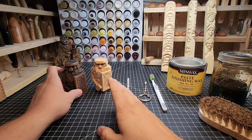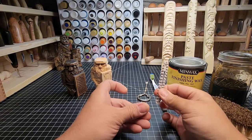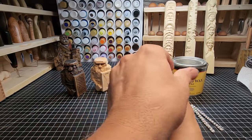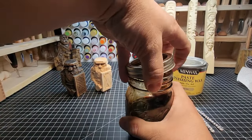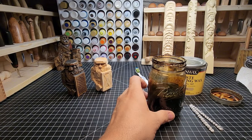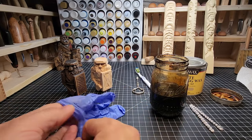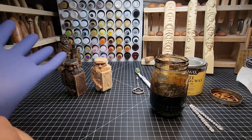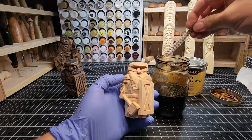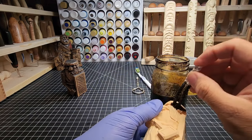They can be handled more than painted pieces — if you paint, carvings can get smudged and stained. For applying this I use a little pipe cleaner folded over in half. I'm going to open up this mason jar I use for storing my danish oil and just dip the pipe cleaner in and apply it directly to the piece. I put a glove on my left hand to keep it clean since that's the hand that holds the carving.